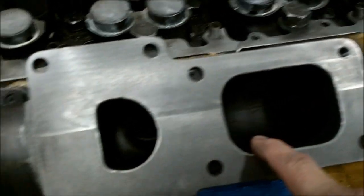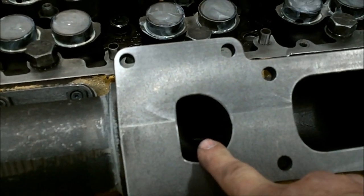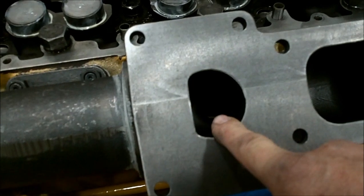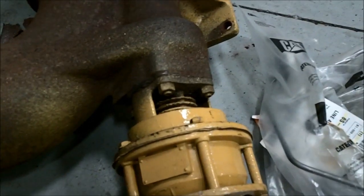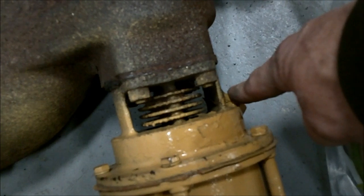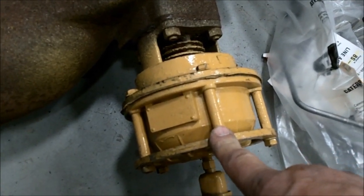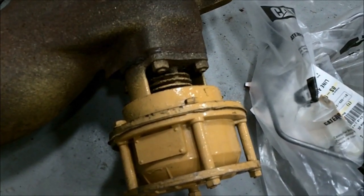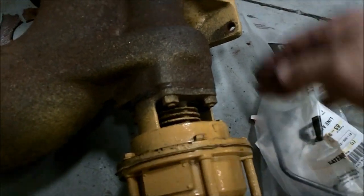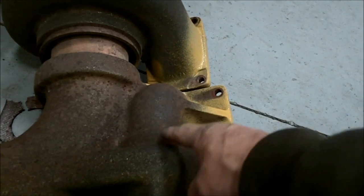Some 1693 applications had a turbo with the split housing — they're a little more efficient than these. This is the exhaust gas bypass. There's a big valve in the elbow. I usually deactivate the turbo bypass valve — I take the line that goes in here and goes around to the boost side and senses boost, and I go in and turn the springs around so that it pushes on the valve. The valve is just like an exhaust or intake valve, only the face angle is on the front side, so it's going to seal in here.